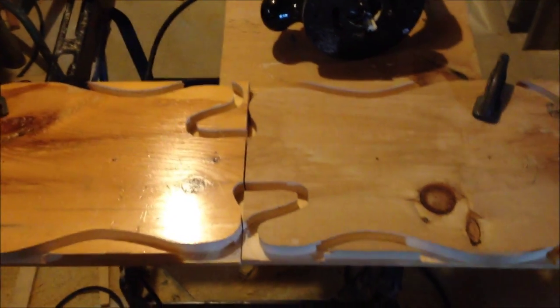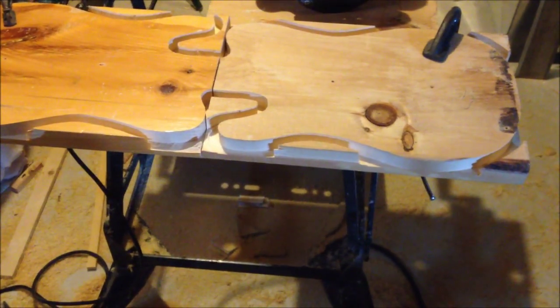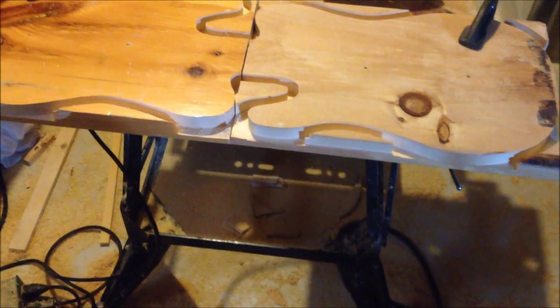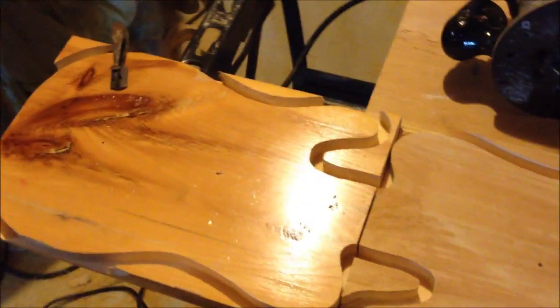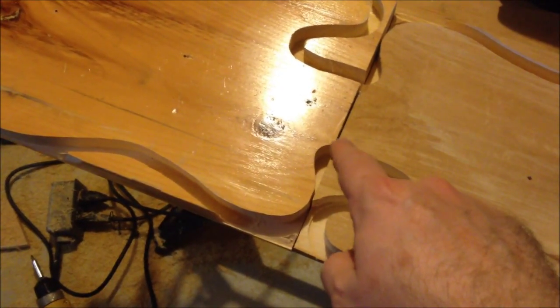All right, set up for one more pass. Templates are off — you can see the screw holes — and the router is set so we can catch that last three-eighths of an inch. That should take care of business. The pieces I don't need just fall away, and I have half the workpiece hanging off the edge of the table. It just needs to not move while I'm routing, and I don't want to hit my workbench with the router bit. I've got a nice little path worked out, starting here, and once I get to this point this bit will just fall out.